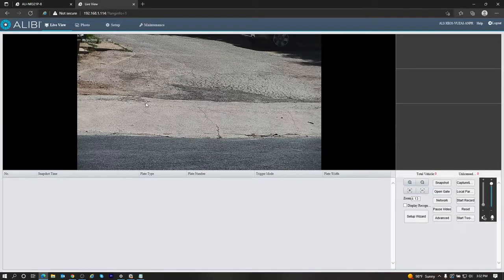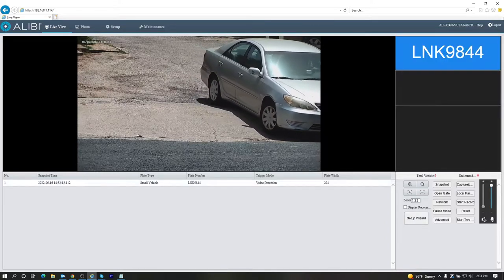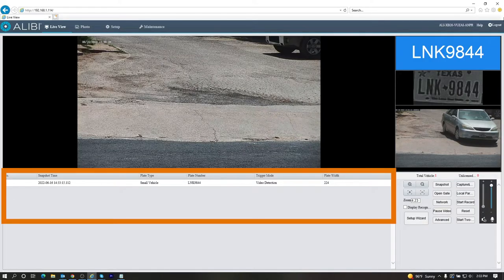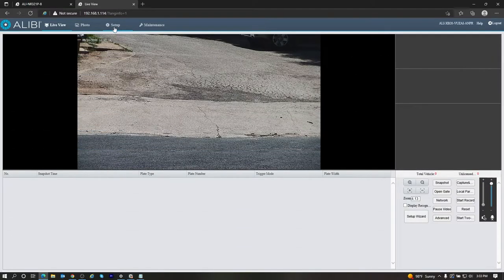At this point this is pretty much set it and forget it. Since this camera is connected via plug and play, there are some limitations on the live view on the camera web page — you won't get the plate data on the right-hand side or the information on the bottom as well. Our manufacturer is working on this, but currently it is a limitation of being plug-and-play connected to a Vigilant unit. If you do want these features, you can connect this camera via LAN and we have a video linked in the description below that you can use to connect it that way.